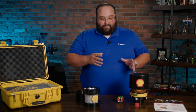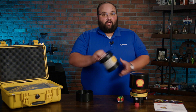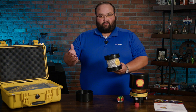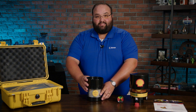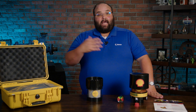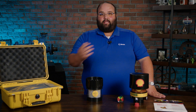What makes these so great — and this is the premium line of desiccant breathers from Shell — is they are very customizable. There are different options such as a particulate screen, so now we can add capacity to the desiccant breather. There is a stacking ring, so now we can actually add more desiccant. The more desiccant you have, the longer it actually lasts. And whenever you have a desiccant that is saturated, instead of having to replace the entire breather, we only have to replace the cartridge that is saturated.